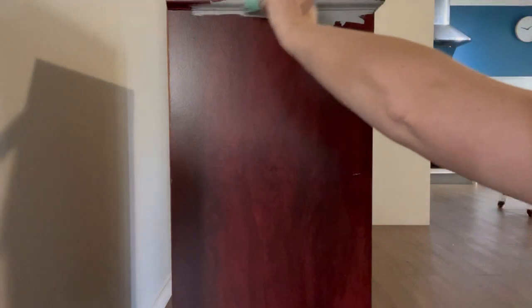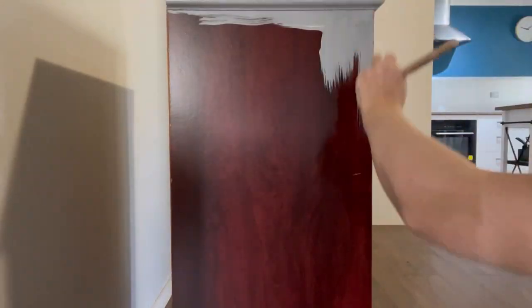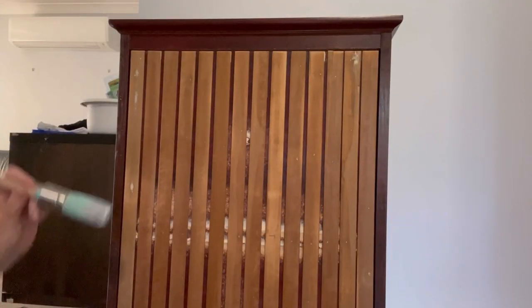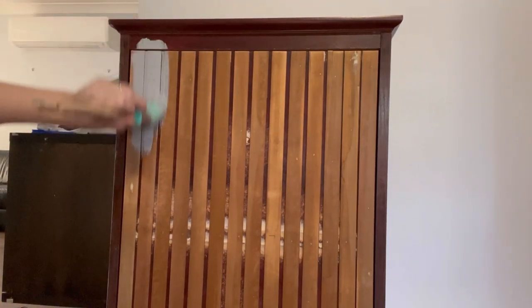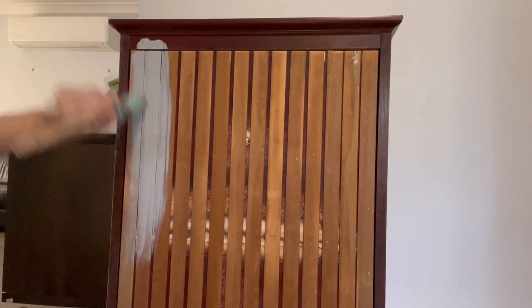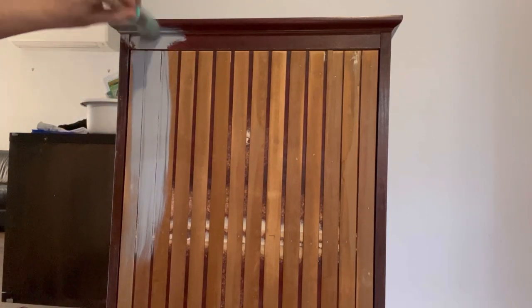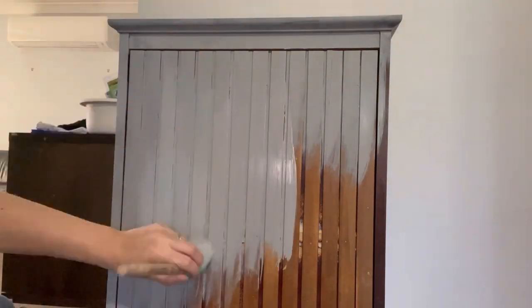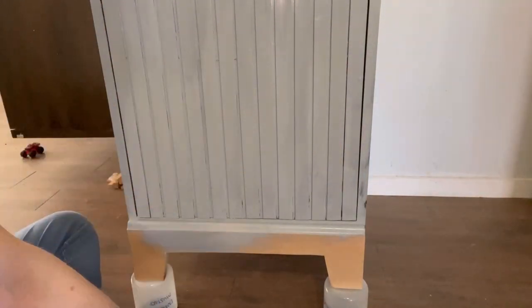I'm using an adhesion primer — the Kats and Millie Boutique Primer and Adhesive Bond, the grey one. I'm using that because the Derwent River colour I'm using — one of the new colours — is on a clear base. So you really should put a grey primer underneath to give yourself the opportunity for fewer coats. It does take three coats of the Derwent River because it's a clear-base paint, but it comes up a treat and I love it.